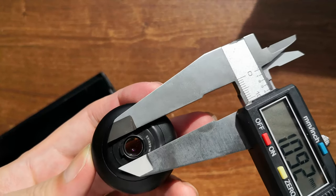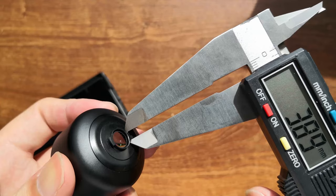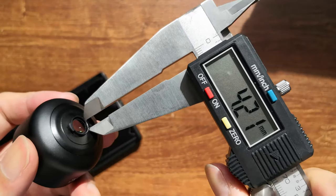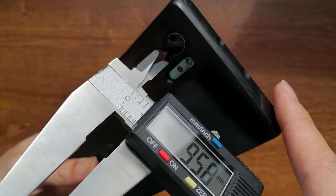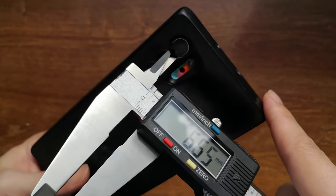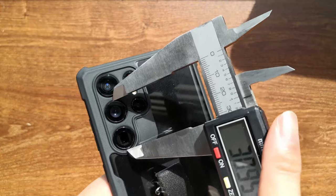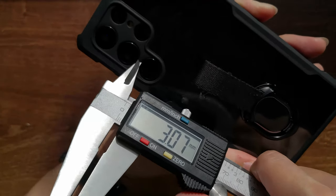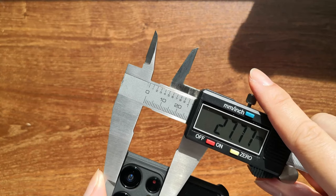Before we start cutting and drilling, some measurements are in order. The diameter of the lens's mount side is around 9.5mm, so we want holes on the adapter just a little bigger than that. The ears, on the other hand, are a little over 4mm wide, so 5mm slots ought to work. To confirm, the mounting hole diameter on the Moment case is just short of 9.6mm, and the ear slots are more than 6.5mm wide — we definitely have leeway. The outer distance between the main and super zoom lenses is 31mm; the inner distance is 3mm, giving us a 17mm center-to-center distance.